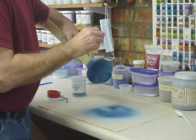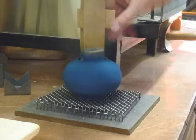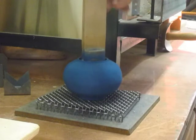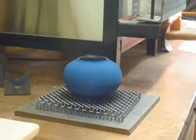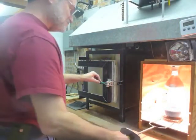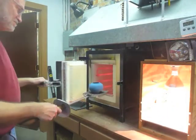When you're transferring the wire rack from the dry box to the kiln, you should use a firing fork to lift up the rack from underneath and then carefully place it in the center of the kiln and seal the door shut. I leave it in the kiln for 2.5 minutes, which is plenty of time for the enamel to melt into a viscous, glossy state.